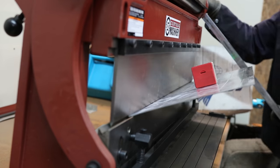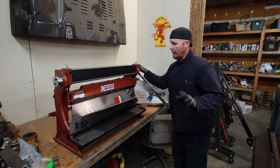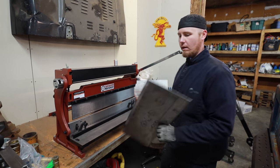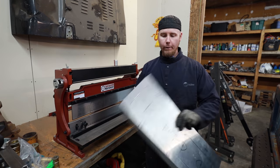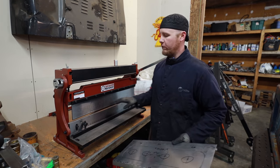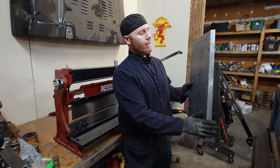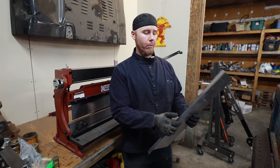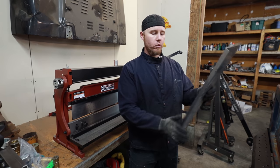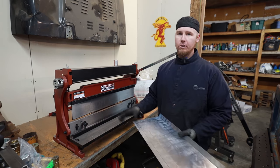There's 10 degrees, so we have a 20 degree bend. I'm going to have to flip this towards me. There's 23, so that means we have a 46 degree bend — nice little bend. When you're going at max capacity of a piece of equipment, especially Harbor Freight, it's not the highest quality. There's a little bit of a bow in the center, so I'm going to take it to the vise and put a little bit of force on the inside to work the piece straight. Then all I've got to do is make the other side match and I can move on.